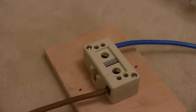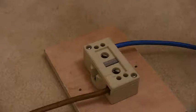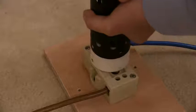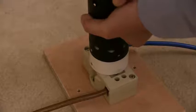This cable is 16mm cross-sectional area and it should be able to handle 80 amps for a short time, and that's connected to that lamp holder. I think we ought to plug this lamp in and give it some power slowly so we can have a look at it. Let's get it in there carefully. Good — that's tight, but we want it tight for a good connection.